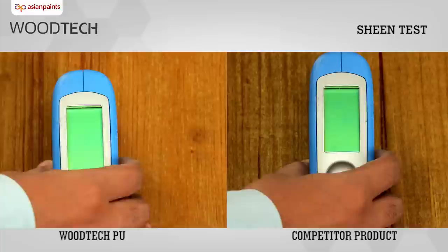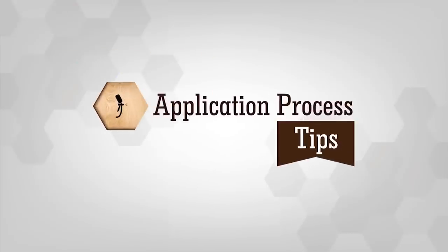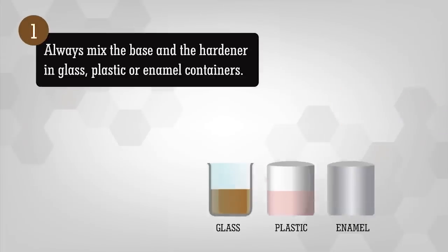Sheen test. The sheen level of a finished wooden surface is measured using a glossometer. The higher glossometer reading for Asian Paints Woodtech PU denotes a higher sheen when compared to the competitor product. Application tips. A few useful tips that would give a better finish. Always mix the base and the hardener in glass, plastic or enamel containers.